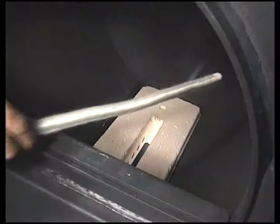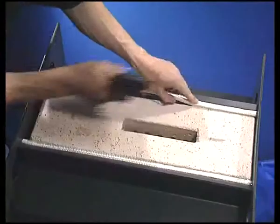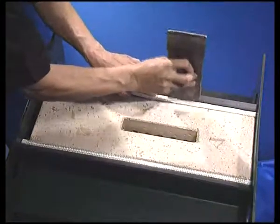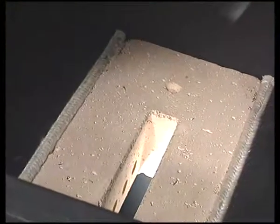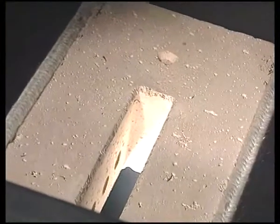The replacement of the heat-resistant shaped piece is finished by installing the sealing cords on both sides and on the front end. It is very important that the sealing cords join each other, and they must fit well in the gaps around the perimeter of the nozzle. The thorough sealing of the nozzle with sealant and sealing cords will prevent unwanted escape of secondary air.